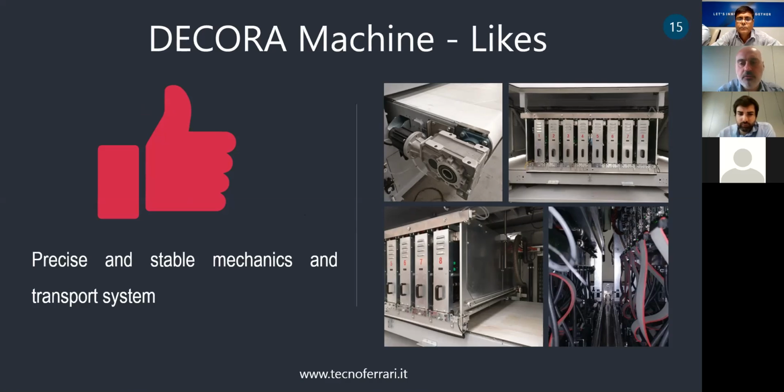Okay, I will finish. So even color bar are now reinforced with the mechanic and added the possibility to be adjustable in X, Y, and Z, so that the print bar will be leveled perfectly to have the print quality across the width that is constant and uniform. Okay, so you can see some of the details of the various adjustment part that we added in the printer.